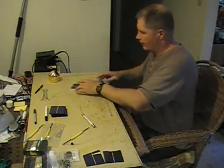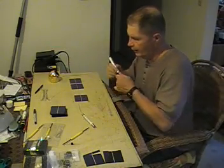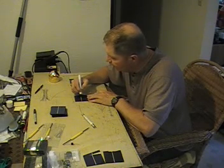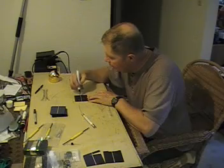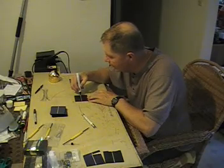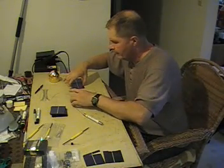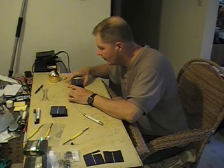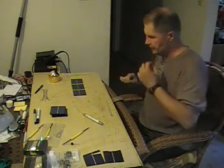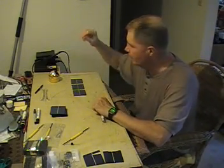After the positive side, do the negative side, which is the top portion. Take your soldering iron and solder along the entire white area. Apply flux — you can tell you have enough when it changes color to a slight yellow. I have all wires pre-cut to the right length, so when I line them up perfectly I have the same distance between each cell. Just watch out for slippage.